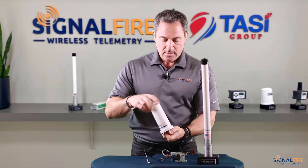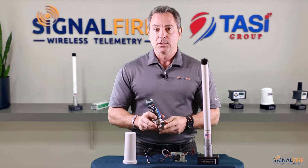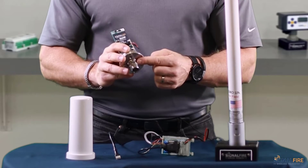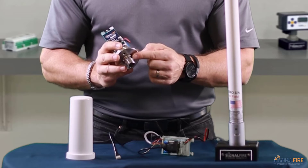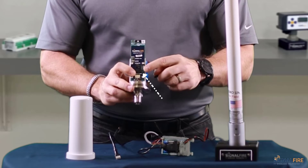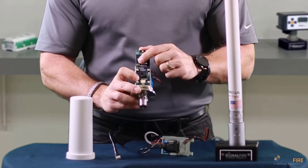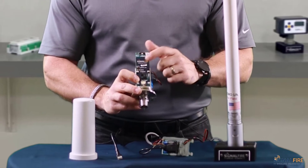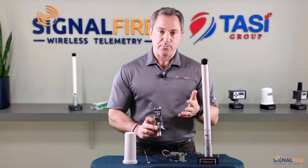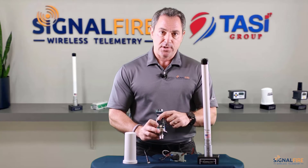Remove the cover. The pressure scout is offered in ranges from 2 psi to 20,000 psi. You can identify the pressure range by the letters stamped on the sensor — this one is a 5,000 psi unit. There's the battery connector and where you insert it. There's also a check-in button that forces the device to check into the gateway, and a zero button used to zero your pressure. Release the pressure to atmosphere, then click and hold until the light blinks back — at that point, you have zeroed the pressure sensor.